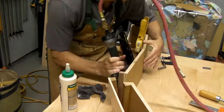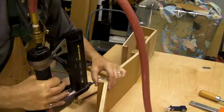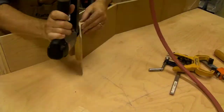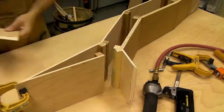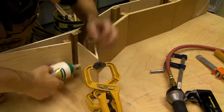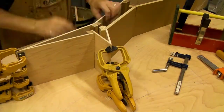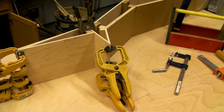Each branch segment is cut to a precise angle to match the design. I add scrap wood posts to increase the strength in the gluing surface. You can see the segments as I glue and nail them together. The really small angles you see at the tip of the branches were cut using a special jig at the table saw.